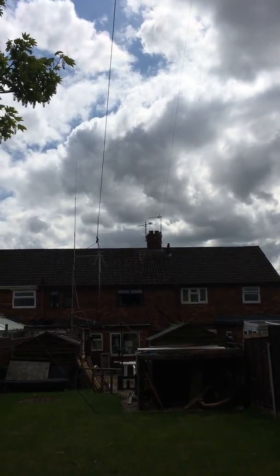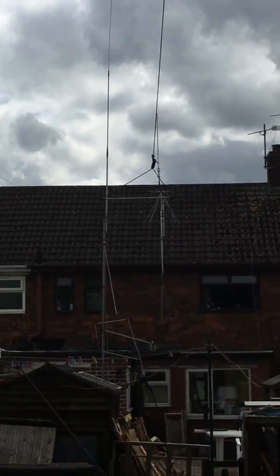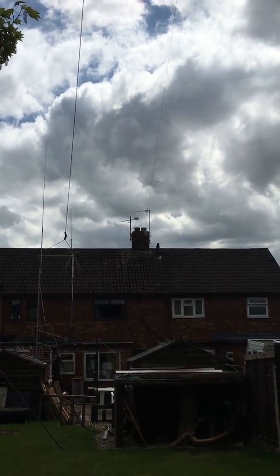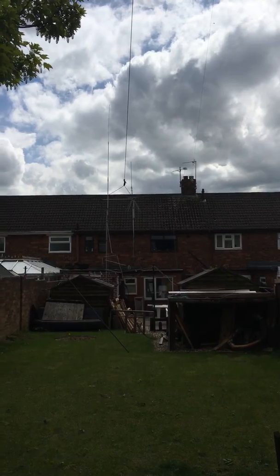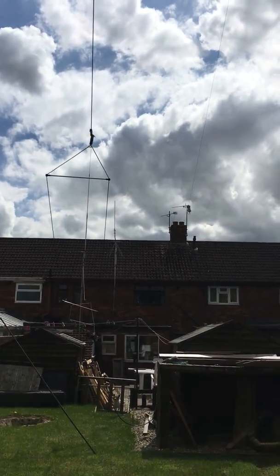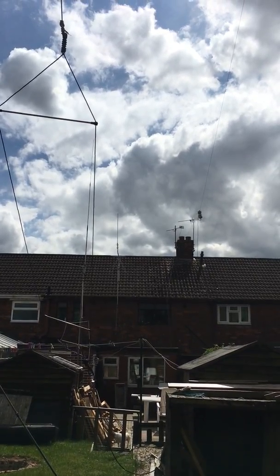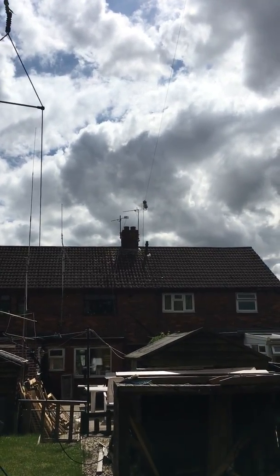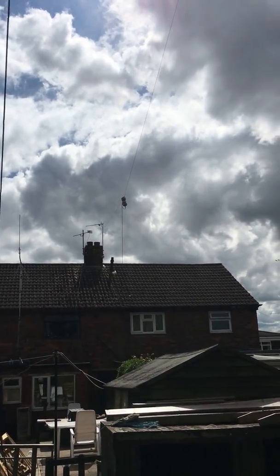Bearing in mind, you're looking at the one that goes to the chimney — not that one, that's the WD330s, which I've used very successfully. I've put this FD4 in because the folded dipole does work on 80 meters. Now that I've been able to go up to 50 watts with my 2E0 intermediate license it works fine, but it does struggle, I've got to admit. So there we go — that's the FD4 off-center fed Windom-type antenna, a third on this side and two thirds on the other side.